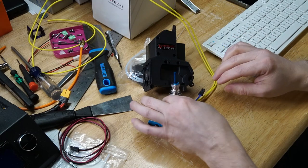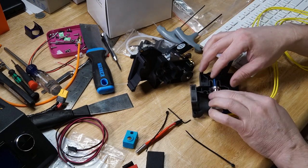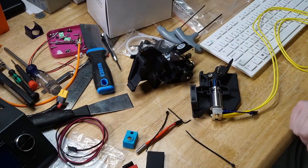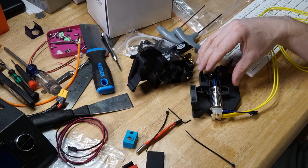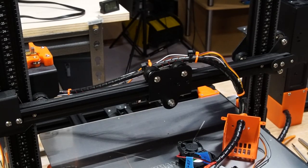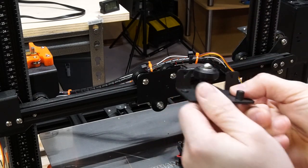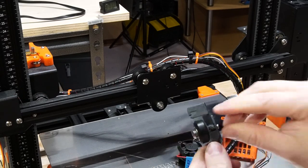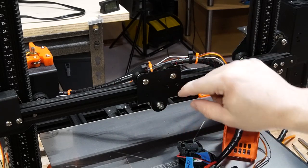Next up is to review the process of getting this installed inside the Bontech DDS, and the E3D V6 is now in position with the Capricorn tube at the right distance. The next step is preparing the carriage — I need to jump back over to the printer to attach this to the CR-10 style carriage. Old carriage is out and the CR-10 carriage is in. Getting the belt undone was a little tricky because of the really weird teeth on this design. I loosened up the bottom wheel, put the new carriage on, then tightened it up.